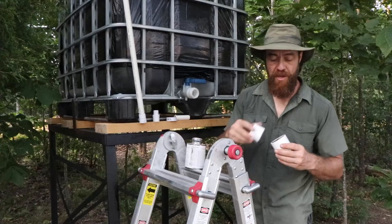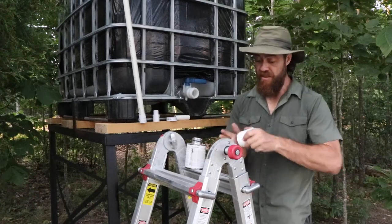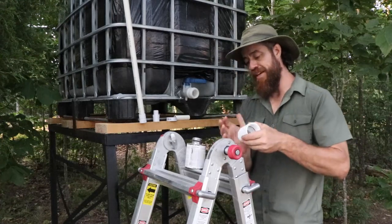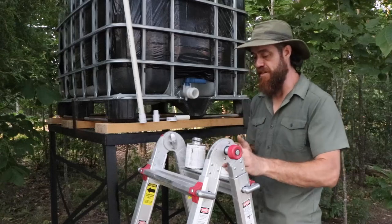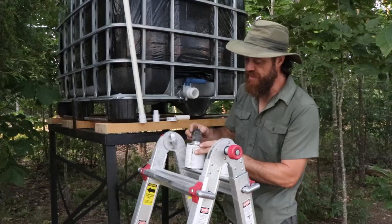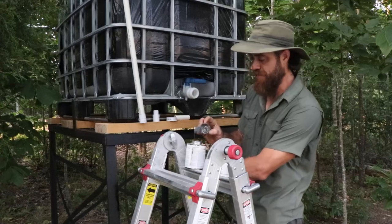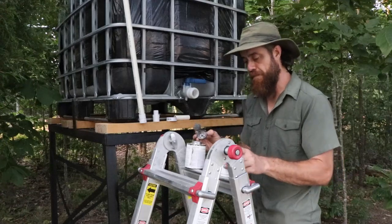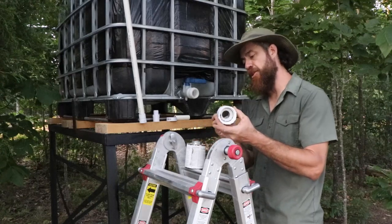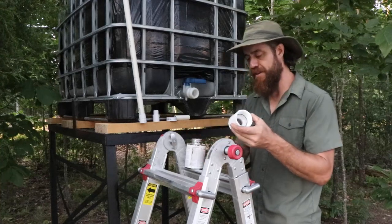That's an option. Option number two is you just don't store water in it over the winter. You just leave it empty, leave the valves open so that they're able to do what they need to do to keep from freezing. That's an option. Another option would be to heat the little room, like throw a little heat lamp in this. We're gonna have a little storage under here. That's also an option. So, I mean, there's ways around being able to use this sort of gravity system over the winter,